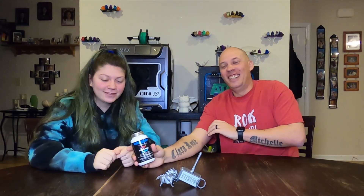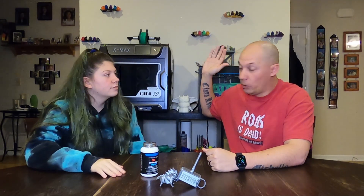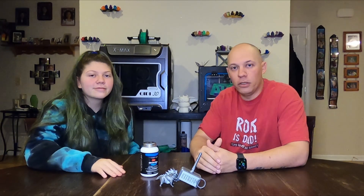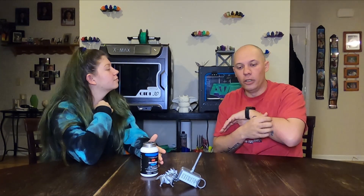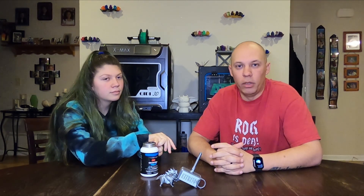So we're going to show you how to do all this. We're going to take the printer apart, strip down the sides, turn it on its side, pull the bottom off, clean it out, and make sure my ribbon cable for my Raspberry Pi isn't kinked up in there. We'll vacuum it out, get a can of air and blow it out. Then we'll apply this silicone paste and the video will show you how. For the nozzle, we'll show you a couple of ways: one way — not so smart — paper towel at 220 degrees Celsius. Not the smartest, but it works. And then we'll use the wire brush to show you the proper way.